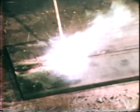To illustrate this method, very short welds are used here, but in actual practice, each bead is laid with one stick of electrode to allow time for the heat from each weld to distribute evenly throughout the plates before beginning the next bead. When we use backstepping, notice how heat from the first weld causes expansion which temporarily spreads the plates. But as the heat moves out across the plates, the expansion in these outer areas, acting against the bead which is cooled, forces the plates together. Each weld becomes a rigid section by the time the next weld is started, so that the spreading action becomes less and less with each succeeding bead, until the weld job is completed without further spreading or distortion.